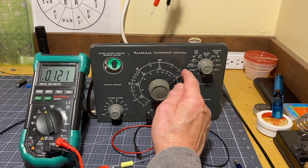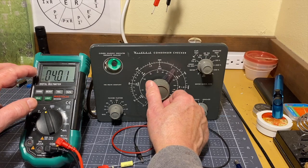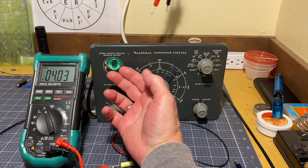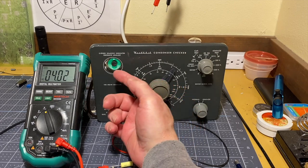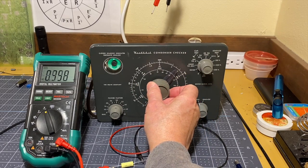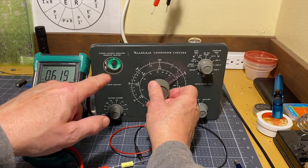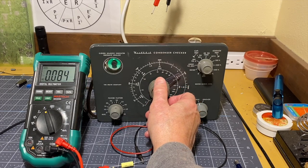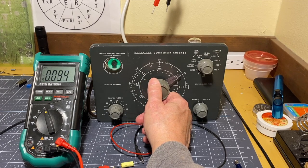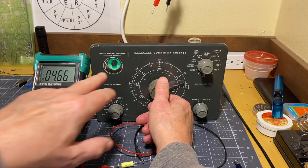If I go to either side of that middle line, that voltage will go up. And that means the grid of the magic eye is now biased to allow all kinds of electrons to hit the rest of that plate and light up the rest of it, so that the eye has closed entirely. If I go the other way, you'll see this drop, drop, drop, drop down. The eye is opening now at about 0.085 volts. Eye is wide open, and then I'll go the other way, and the same thing happens. The AC voltage on that plate goes up and allows this to close.